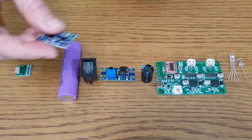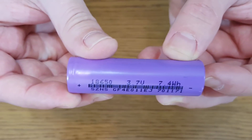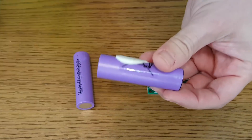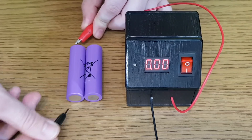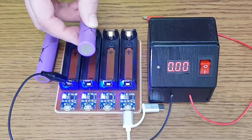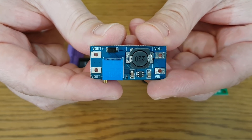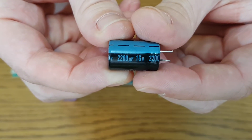So I'll use instead a TP4056 charging module with battery discharge protection, which is very popular. I already have a 2000mAh lithium cell left over from my DIY voltmeter project. I'll use another identical battery from this cheap one-cell power bank, which also has a battery holder so you can use it as a simple 18650 battery charger. These cells are almost brand new. To increase the voltage from the battery's nominal 3.7V to the 5V needed by the Bluetooth amplifier, I'll use a 2A step-up converter and a 2200uF capacitor to keep the supply voltage stable.